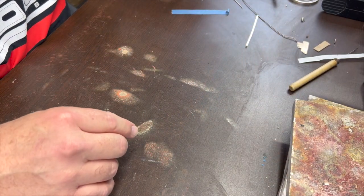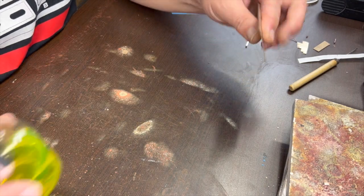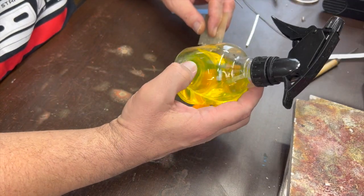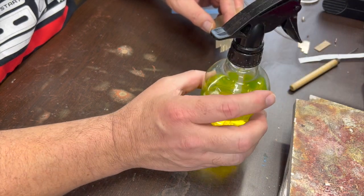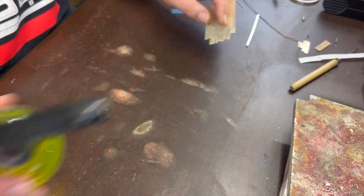If you're new to my channel, as far as soldering goes, I use pretty much exclusively hard silver sheet solder. This is my flux. It's a spray-on flux, and it's Mighty Flux from Rio Grande. It's pretty much the same as Batterns self-pickling flux if you have that available in your area.